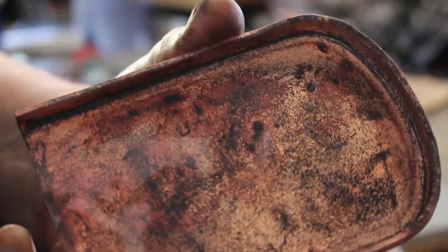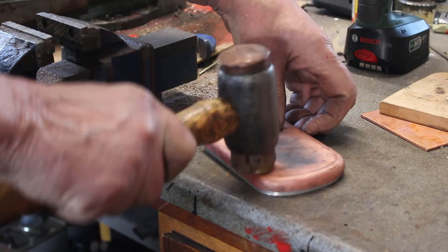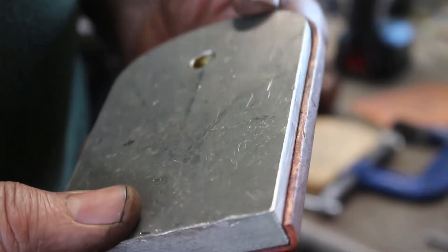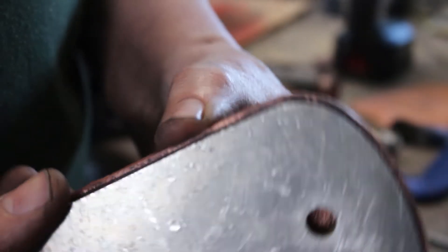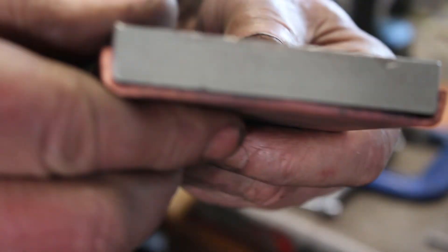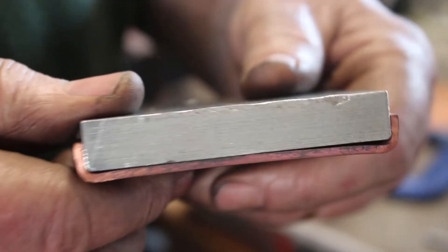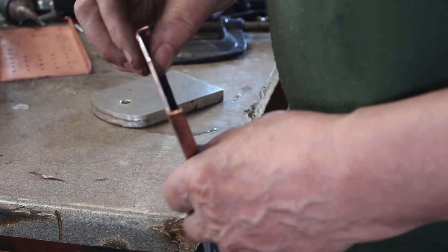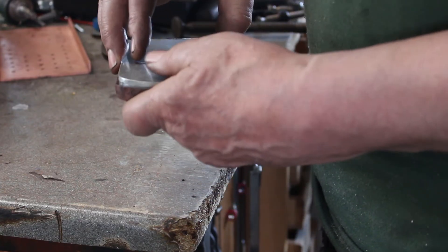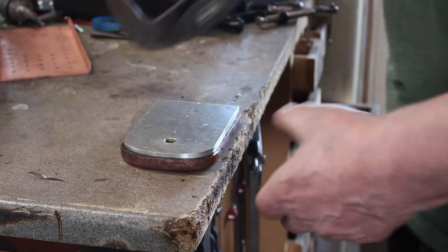It's pretty much fitting quite nicely onto the former, though it's still a little raised up at the ends. I'm going to give it one more anneal and then just try and flatten it out a little bit — not that it really matters that much. I'm just going to put the former back in, put it on the bench which is relatively flat, and give it a squash.